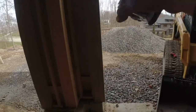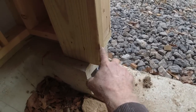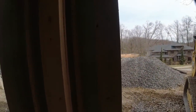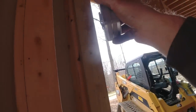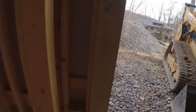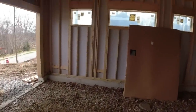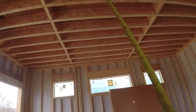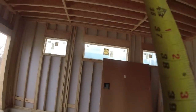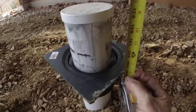Here we have an 8-foot garage door. 8 foot goes to our top of sill — it steps up an inch and a half, so floor height is an inch and a half higher than that mark. I'll take my tape measure and hook it right up here on my floor joist and pull down 132 and a quarter. That is my wall height. So my floor drain height is 2 inches greater than that — 134 and a quarter will be my drain height.